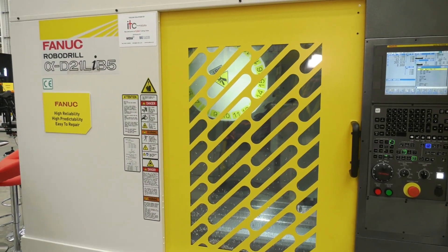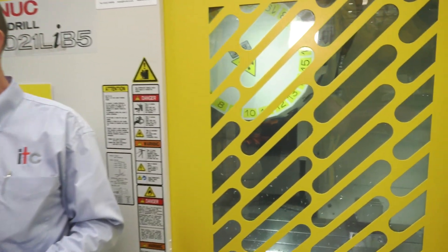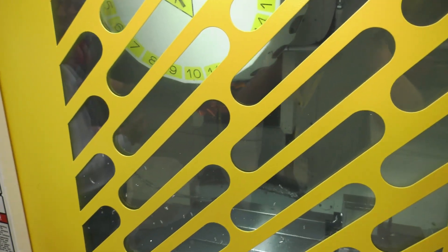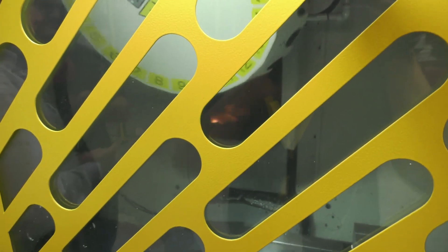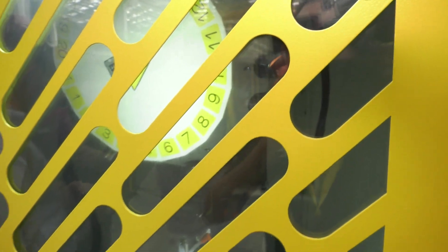The chip fan is actually machined from a solid billet aluminium, making it a very strong integral piece. It's got a through centre hole which allows you to blow air or coolant through it to wash parts off, and the rotational speed goes up to 12,000 RPM to give you a very direct air blast over the top of the part and around the machine to actually clear the swarf.